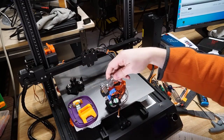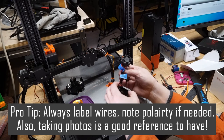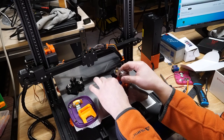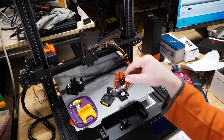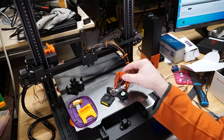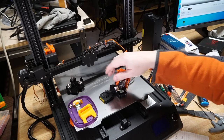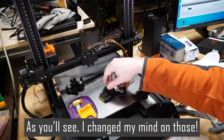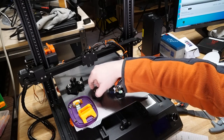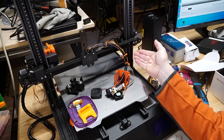I've already labeled the wires — this says always-on fan and part fan. I'll have to splice in the fans that go to the DDS from those leads and just reuse them. I do have some solder connectors, but they don't work well with these very thin wires. Frankly, it's better to use the Western Union method — twist them together, solder them, and put heat shrink on top. That's my plan.